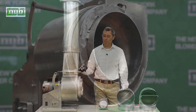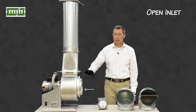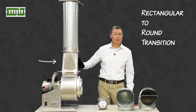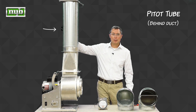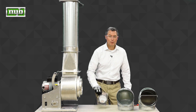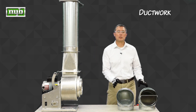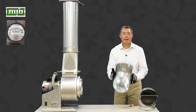Let's move on to the demonstration. But before we actually do the demo, let's talk about the equipment. We have a centrifugal fan with an open inlet that allows for uniform loading of the wheel with air, a rectangular-to-round transition, a round piece of ductwork, a pitot tube to record the amount of pressure the fan is generating, and a damper to help generate about one inch of resistance — or about 250 pascals. We also have a visual meter so you can see what's happening in two sections of ductwork: one open, one vaned. Let's see how these change the way a fan performs.